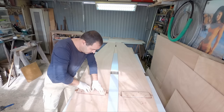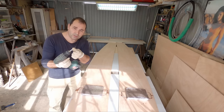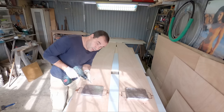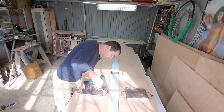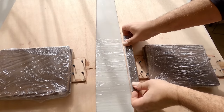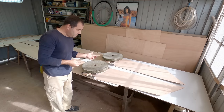There are a few different ways you can hold the butt strap in place: you can put some weights on it - that's about seven kilos, 15-16 pounds - or you can just use drywall screws. Don't put them all the way through, and if you're varnishing the panels be careful because if they go through you'll have extra work on the other side. Getting these panels ready and glued took me roughly one hour.